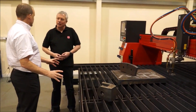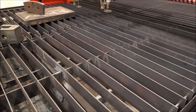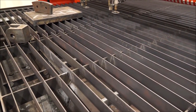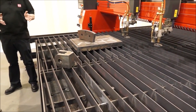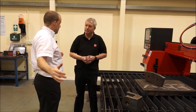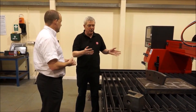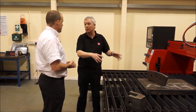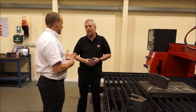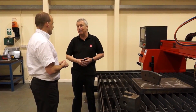The table on show here is something of a luxury in the oxyfuel cutting arena — inside a factory environment it would be the Rolls-Royce of cutting machines. People often fabricate their own tables to suit their applications, buying just the crossrail and attaching it themselves. As for fume extraction, it's optional for oxyfuel but mandatory for plasma.